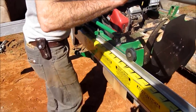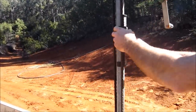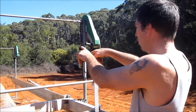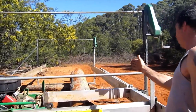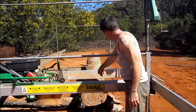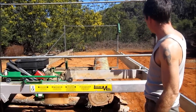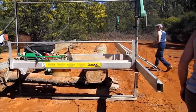That adjusts our cut on the horizontal. These are our cuts on the vertical — so we go up and down, work out our increments. Now we've just got to true the machine up. What we're looking at is getting the two rails parallel. Doesn't matter if it's tilted this way or that, as long as the rails are parallel. You true your log up to your machine — measure your height from the top of your rail or trolley down to the centre of your log, and again from the side of your rail over to the centre of your log. You square that up. Basically we're boxing out around the heart — cutting straight along the grain. All pretty simple, and fun.